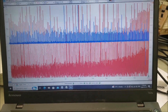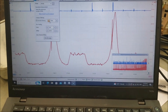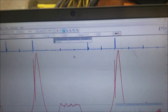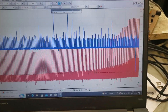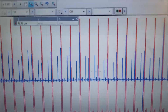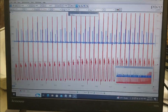Let's zoom in on one of these captures and apply some filters to clean it up. Slowly raising the RPM — this is going to be our exhaust plateau. Looking at the pressure, it averages out at 13 psi at idle. But once we slowly increase the RPM, the pressure towards the exhaust rises to a whopping 42 psi. So this is a plugged exhaust — most likely a catalytic converter.